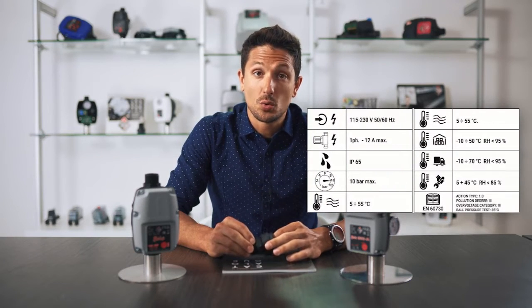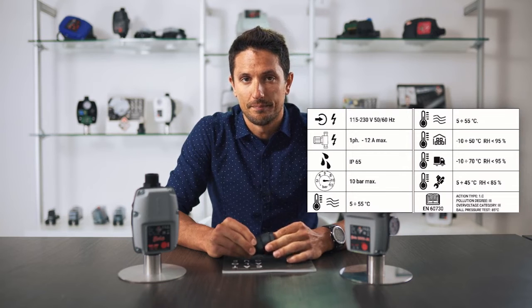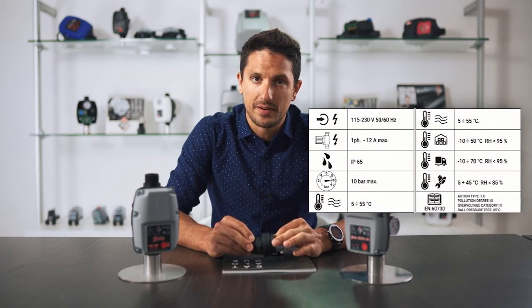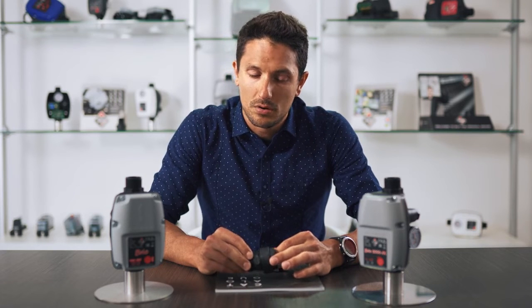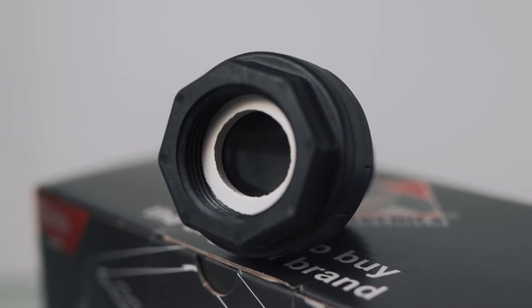Maximum power is 2 HP and the factory setting range is from 1 bar to 3.5 bar. The minimum flow has been reduced to 2.5 liters per minute, thanks to the completely redesigned non-return valve body. This will reduce the continuous start and stop of the pump in case of lower flow rates. The Brio is also available with revolving connections included in the packaging.